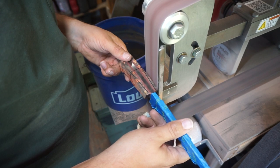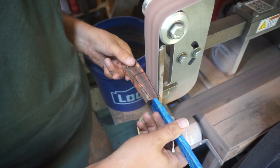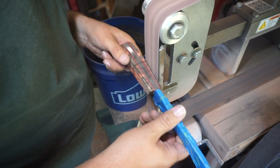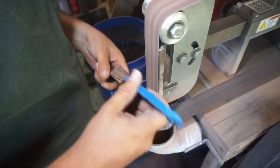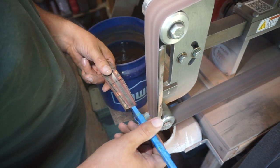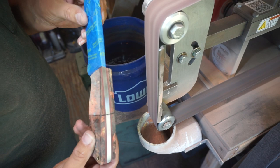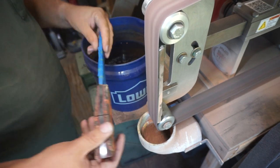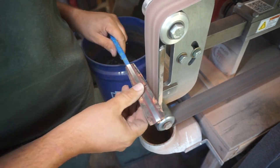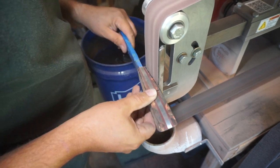What I'm wanting to do is keep the handle scale material there — I don't want to go all the way down to the G10 and have that exposed at the very front. I went just far enough down to have a thinner piece of handle scale material towards the front. The more aggressive you get with these shapes, the cooler the coke bottle shape is going to be, so don't be afraid to really get after this part. Check this over and over again in your hand to make sure that palm swell — the area where it's at its widest — is in the right place.